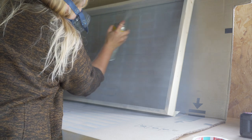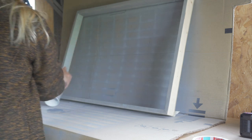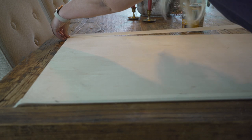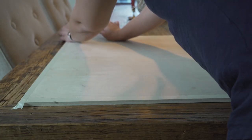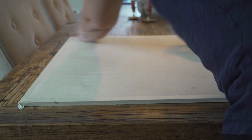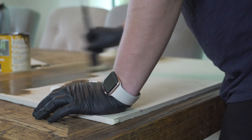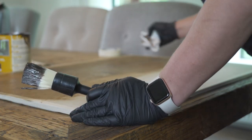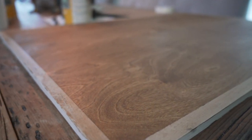I did the same thing with the frame but only on the inside for now, as I have some other tricks planned for the outside. To prepare the backboard I took it inside and taped off the edges of the plywood, because it's always better to glue bare wood than stained wood, so I kept the edges completely bare. I tested two different stains on the back side and chose the lighter one, because the rest will be black and I don't want it too dark — or you won't even notice the beautiful wood color inside. Although once it's filled with little cars, you might not see much of it anyway. Oh well, I will know.